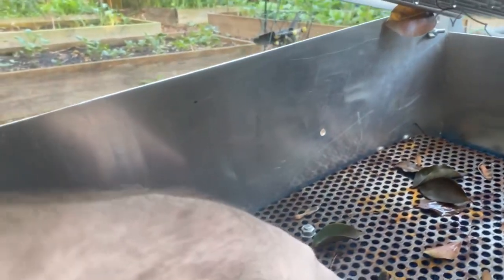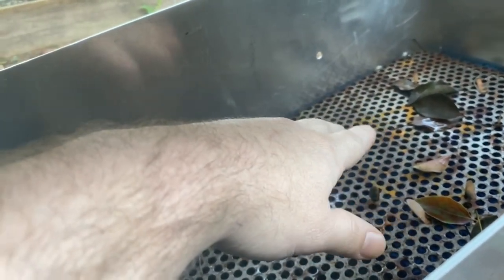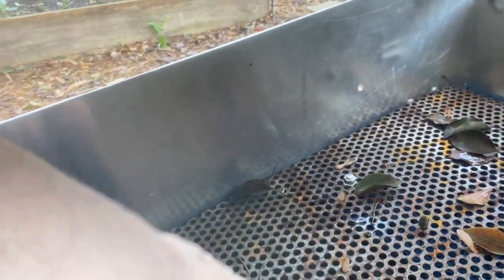I didn't like where it was because it was down here, and from the screen where the material starts falling in, it was falling right on top of the damper mat. In my opinion, that makes the gold kind of suspended at the top of the water when it gets introduced. So I want that gold falling down right away into a nice little protected zone.